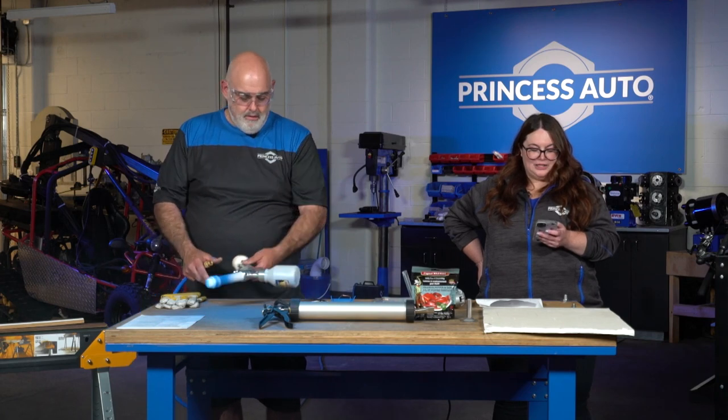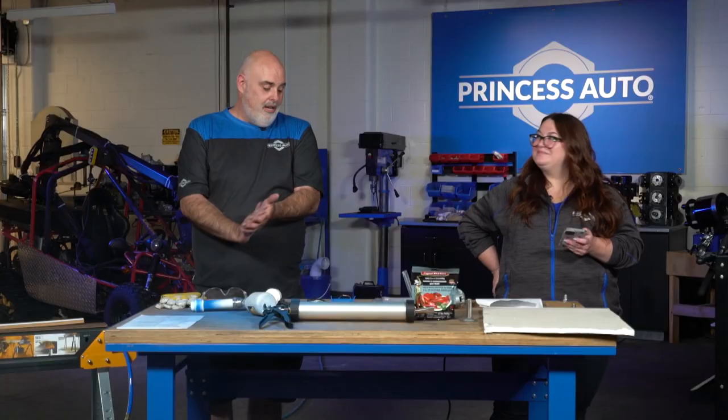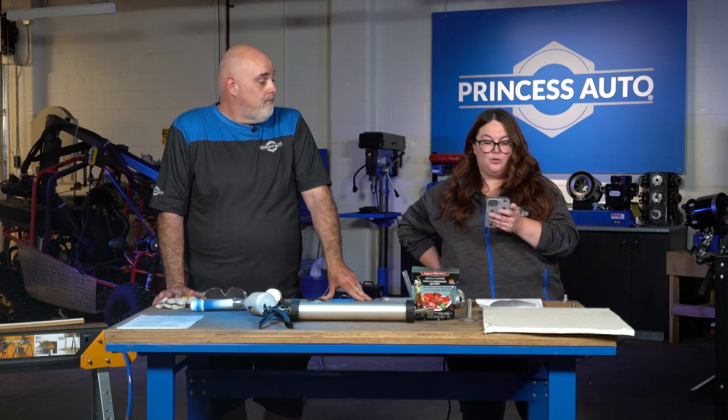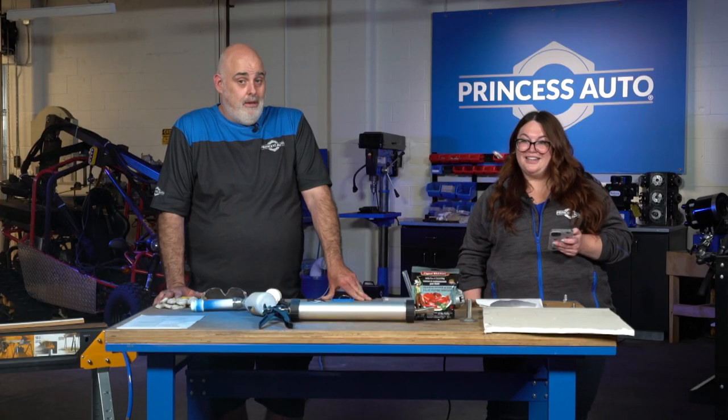That's pretty decent coverage on there — beautiful, no shiny components showing through. It gets hung in an oven and baked. I've got a bunch of powder coating to do this summer, so I've got a large household oven type thing set up in the garage. Ryan is wondering how safe the unused powder is — as long as you don't ingest it, there's really nothing that can go wrong with it. Tracy asks — yes, you can coat washers for washer toss. Some guys even coat their bullets.